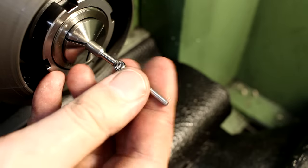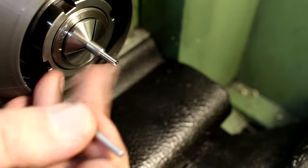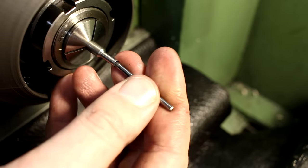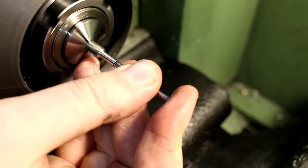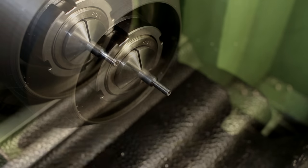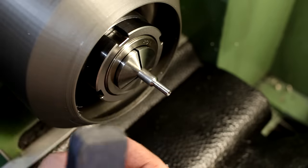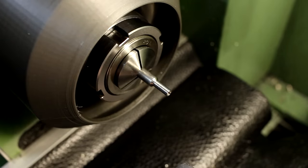Large ball carbide burr, putting a small chamfer on large counter bore, and the small ball nose burr to deburr the hole in the bottom of the pocket. Just doing it by hand. Kratex stick, just to shine up any machine surface, round over every tiny sharp corner, and remove any hairline burrs.